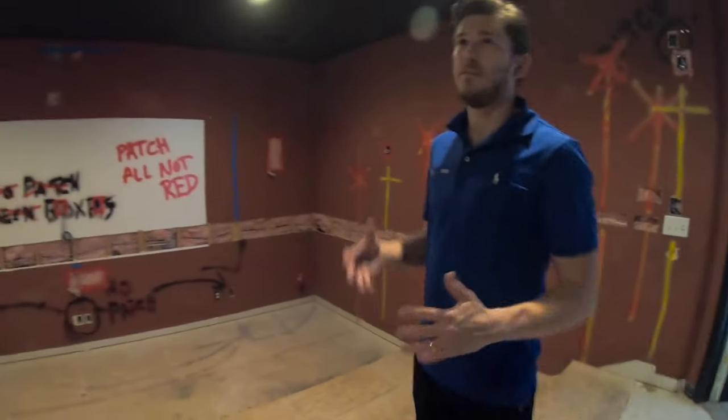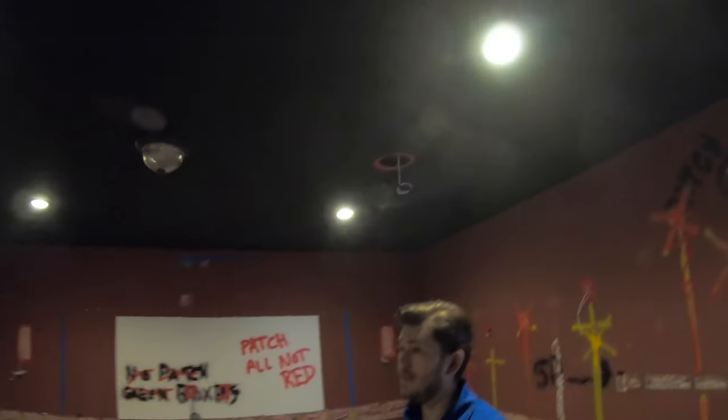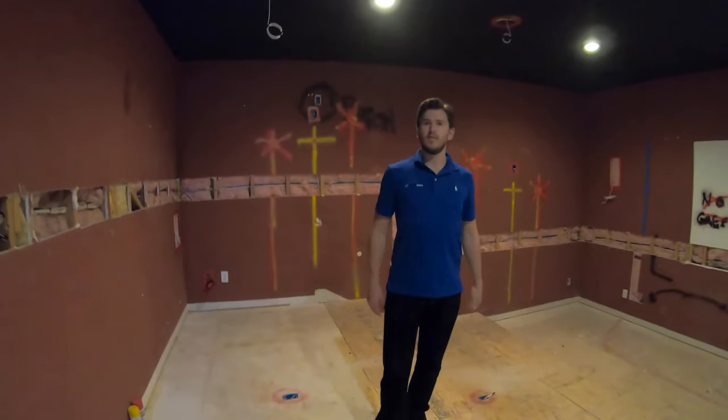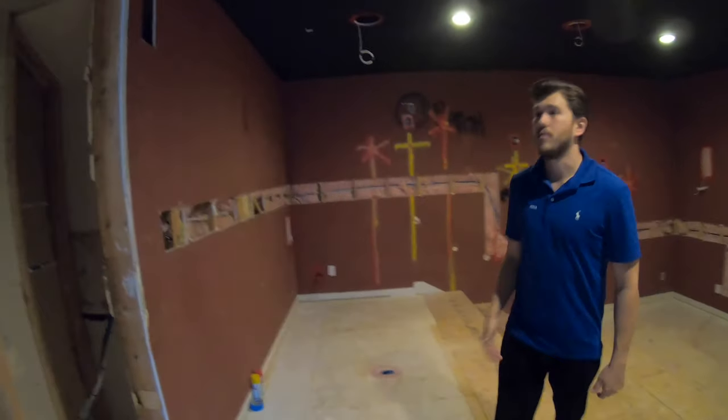This is an Atmos system so we did four overhead in-ceiling speakers, lined up right in line with our first row and our second row. Everything's pre-wired and cut to size so when we come back we just pop them right in and start the fun stuff. We also put in two 4K HDMI cables — 18 gigabits per second, 4:4:4 — to make sure we're maximizing video resolution. We're going to be using a Sony 695 on this project, and there's an outlet there as well.